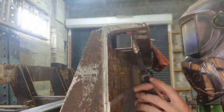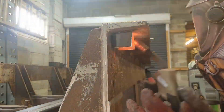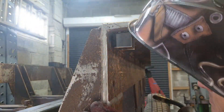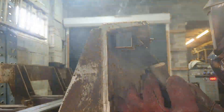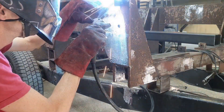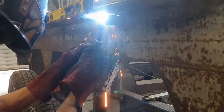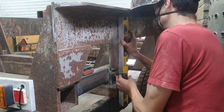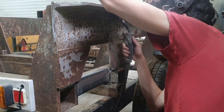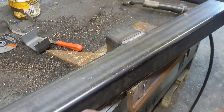I've got a scrap of 90 by 90, that tiny little red slither, in order to position it correctly. You can see the leg just pushes on from below. Now to blast that on — obviously I need to get that well attached because that's going to be helping to support the weight of the rolling road and the car when it's on top. There are four of those to do because I'm going to have four leg locations in order to get around this weight problem. Those all get welded on — I think I've welded all those on in a permanent fashion right from the get go. But there's still quite a lot to do.